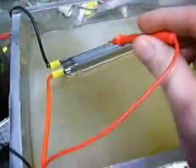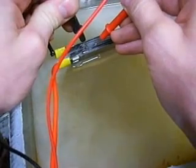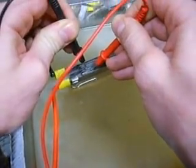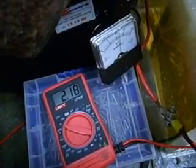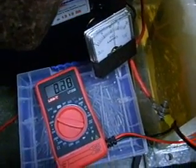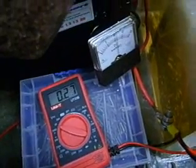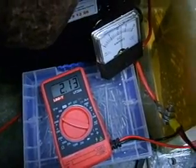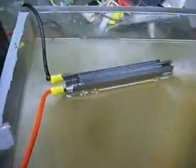Now I'm just going to see what's between the plates. This is the cell that came out of my dry cell unit. We're getting 2.18 volts between each plate. I'll try another plate — there might be a bit of difference. 2.13 volts. The gaps in this aren't perfectly uniform all the way through.